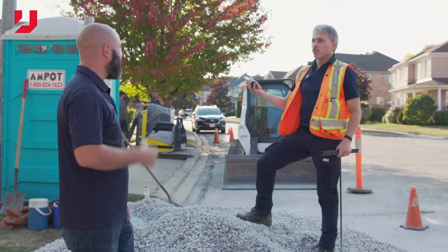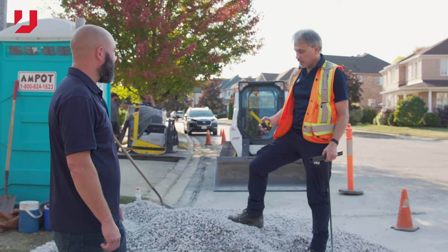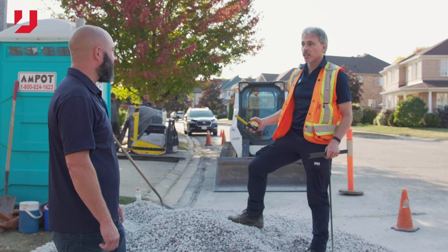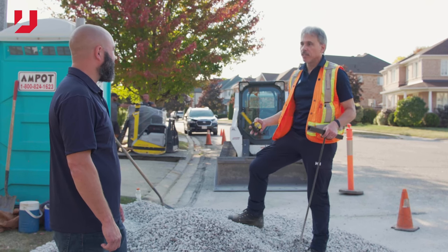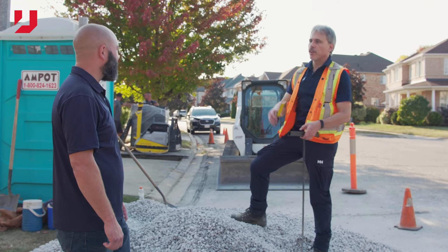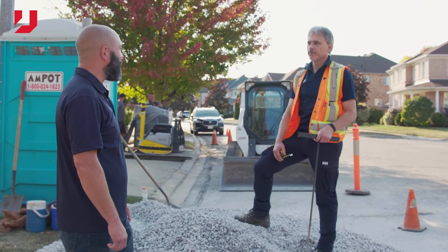And then when we move over to the driveway and see how it compares to being compacted, there'd be a significant difference. And we'll also check the native soil too, so we can get an idea what the subgrade strength is. So you have the soil underneath, and then the soils that you're actually building your pavement structure with.